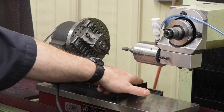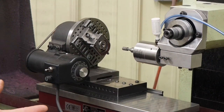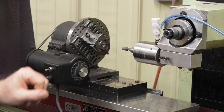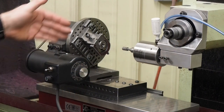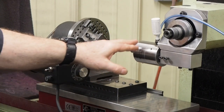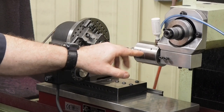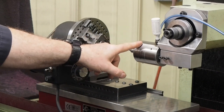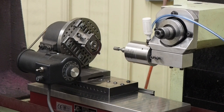By using some of my templates in the back, it's real easy to get 30, 45 degrees, 10, 15 — whatever template I have set up. I can throw a sine bar in there and get some really super accurate angles by turning the whole spin fixture at an angle. I've been using this setup — not this specific unit, but with other NSK Planet air spindles — for about three decades.